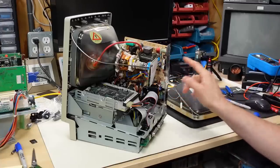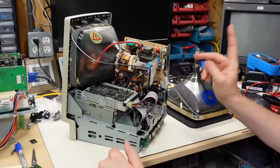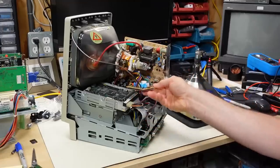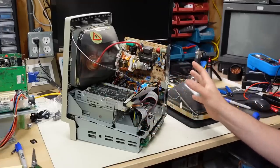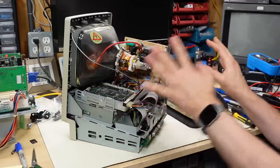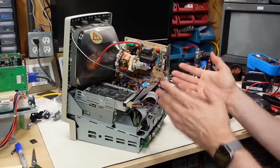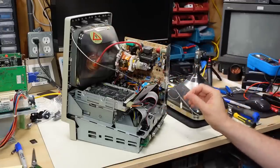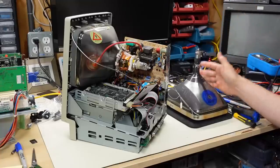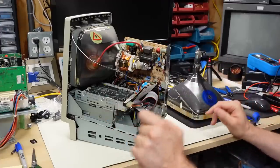The very first thing you need to consider if you're going to try a swap like this is: you need to make sure the two CRTs are, A, the exact same size — these both are, they're 9-inch — and second, that the connector on the neck is exactly the same from one CRT to another, because if the connector doesn't physically fit, there are almost certainly electrical differences that will prevent the swap. Luckily, both of these CRTs were manufactured in the 80s. The CRTs in all classic Macintoshes are the same going back to the original Mac 128 from 1984, and the Apple IIc monitor also came out in 1984 — so these are probably very similar and intercompatible.